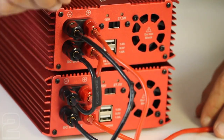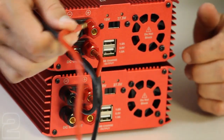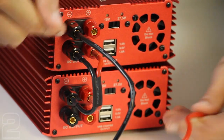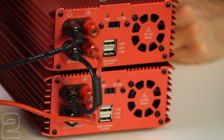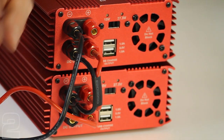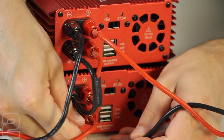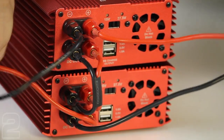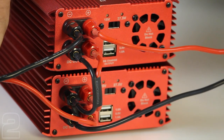So we're going to wire it a little differently. We'll take the 1430's lead — positive at the top and negative at the top — then plug into the bottom posts for the opposite polarity. Now the 1430 is connected to the upper and lower posts and has 40 amps available to it. Same thing with the 820: positive in the top and negative at the bottom. Now both chargers will be able to see the available 40 amps between the two parallel power supplies. Make sure your voltages are set the same.